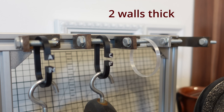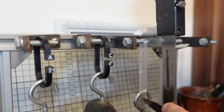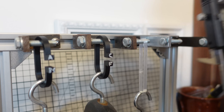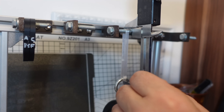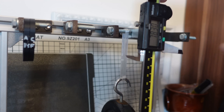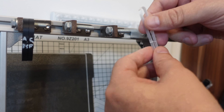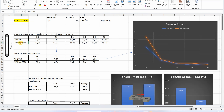Creep — deformation under a constant load of 1.25 kg. Unlike the previous two measurements, this is part of my regular TPU tests. The reading at day one was 74.51. On day five, time for the last measurement: 78.30. It has quite a lot of permanent deformation, much more than regular TPU materials. TPU 72D had smaller initial deformation compared to TPU for AMS, but the creeping difference between the two days shows that only on day one did TPU for AMS have bigger creeping — later it stabilized and was very minimal.